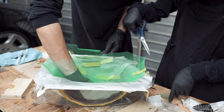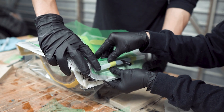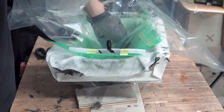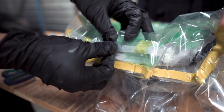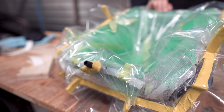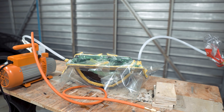This next part was a bit tricky. We placed a vacuum tee in a plastic hose wrap and taped it along the short ends of the mold on top of the breather material on both sides. Then we placed a big sheet of vacuum bagging film over the mold, making sure to seal all the edges with tacky tape. We made large pleats to help crease the film and get into all the nooks, then cut holes for the vacuum tees to pop through and sealed the edges. We also used an empty Coke bottle inline between the pump and mold to catch excess resin as it sucked through.